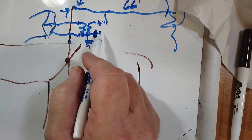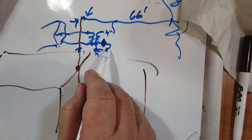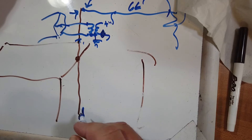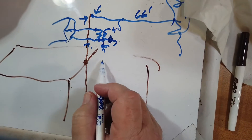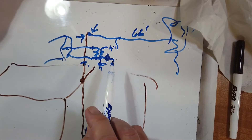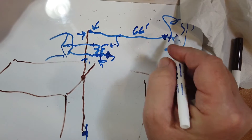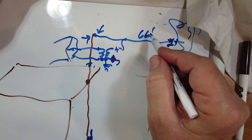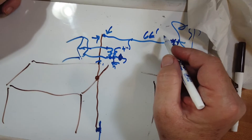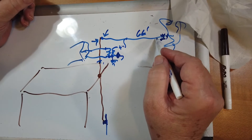This goes to a counterpoise or something — it could be as simple as the pipe itself. If that doesn't work, try running a wire down to a ground rod. You'll have to experiment a little, and you'll find a place where you can do very well and get your antenna to tune well. The only tuning you have on this is the length. The problem is this affects all bands, so if you bring 40 meters in right in the center, it might throw off 20, 15, 10, and so on. You need to find the right compromise for length on these, and if you do it right, you should be able to get a good serviceable antenna out of that.